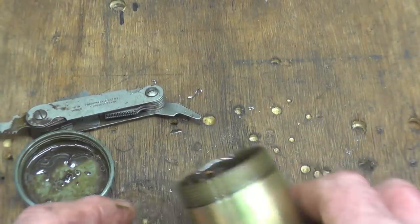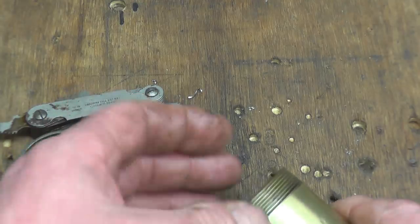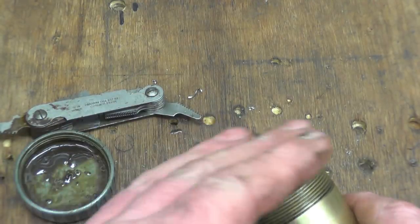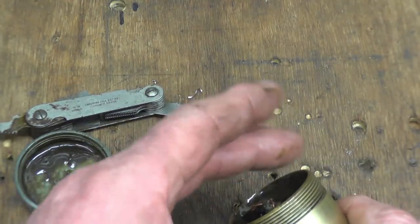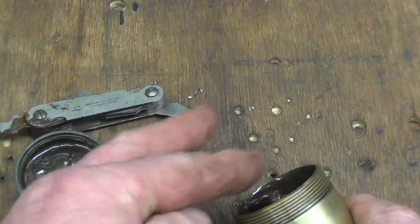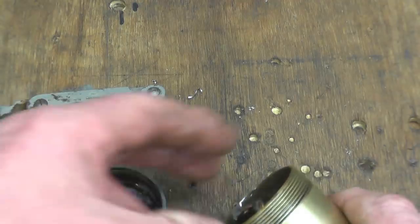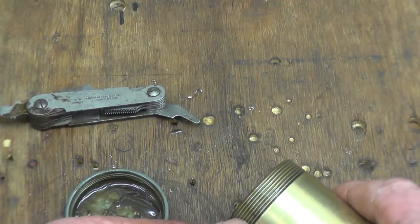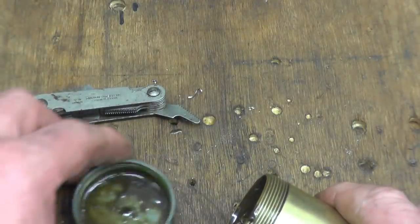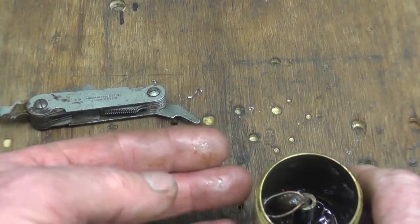So what I think I'll do is screw cut a length of brass tube to fit that, instead of making it out of the solid, and then silver solder that end zone. On the end it's got a nice fancy shape around the outside, and a slight dome on the top. So I'm going to machine a piece of brass bar, with that thread, to screw on there. I'll also have to machine a dummy shaft to screw them on so I can work them in the lathe. And we're going to fabricate them that way instead of machining out of the solid.